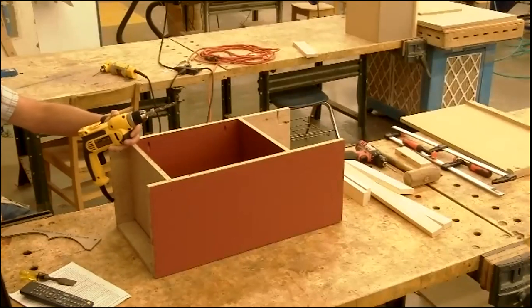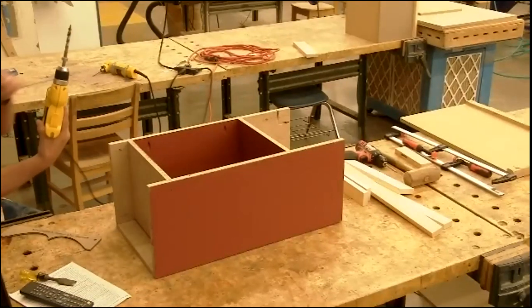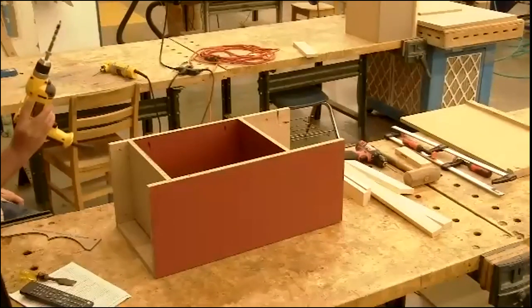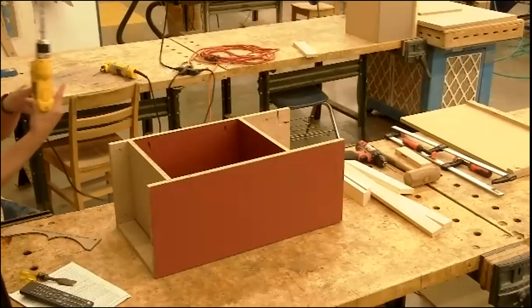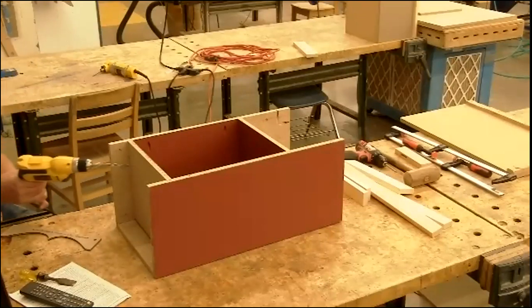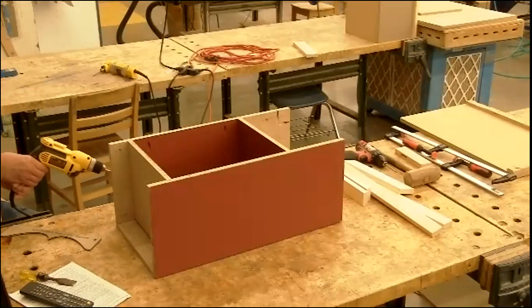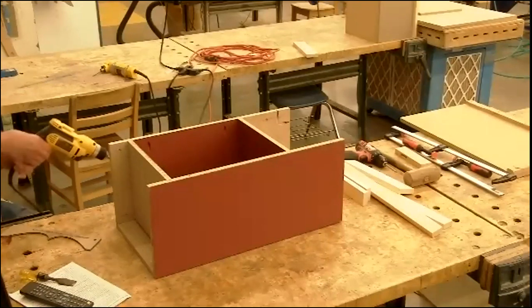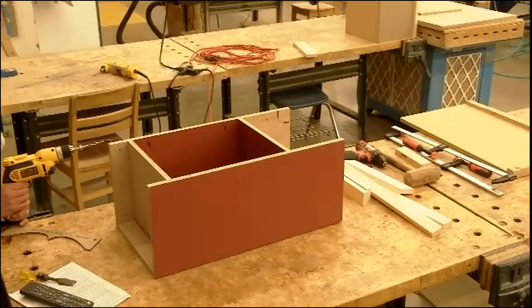Now, there's a reason this shape is here and this softer rubber is here. My hand fits perfect just like that. My finger follows on this piece of black soft rubber. My thumb wraps around this piece. There's a reason for that. If I run a drill like this and start drilling in like this, chances are my drill is gonna tilt down or tilt up, and with smaller bits, you're taking a real good chance of snapping the bit off in your work.